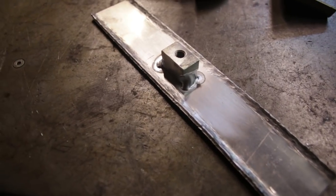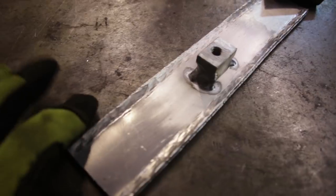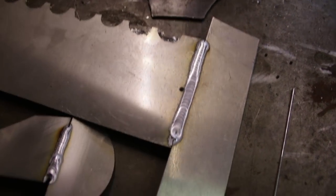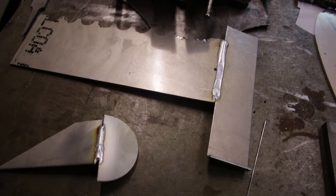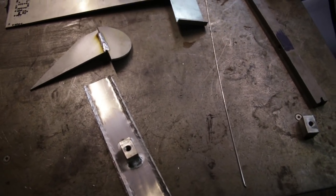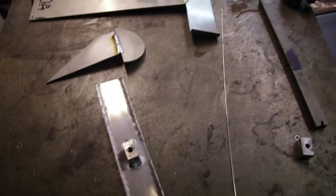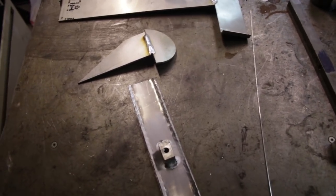This block that's been tapped has now been welded to the outer portion of the bumperette. You can see the welds along this edge and along this edge. I've started to set up the welder for the aluminum welding on the edge - trying to get the right penetration. This was a little bit lower amps, a little contamination, not fully cleaned, but I think it should be close enough just to get this part tacked in place on the car. Getting it tacked in place is not entirely straightforward because it's not just a square bumperette. I've got to accommodate some angles so things line up with the deck lid - it's a little trapezoidal - and I'm trying to make it appear narrower from the back.